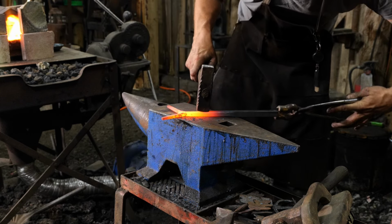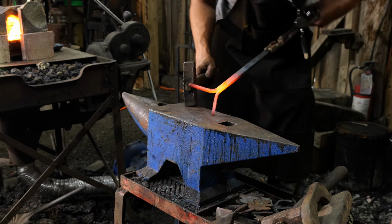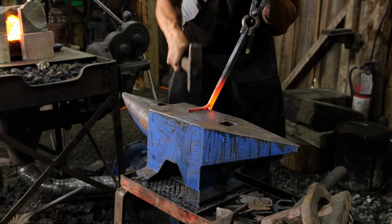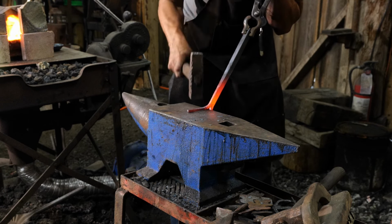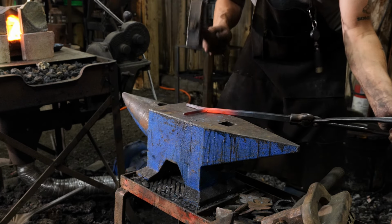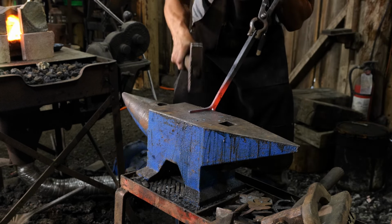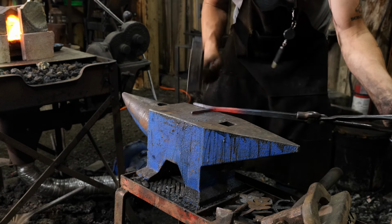And now Thomas is going to try to create, instead of a barbecue roasting fork, what we're trying to accomplish instead is that same asymmetrical taper that we did for the handle, but now we are doing it in the plane like you see it. So we're going to thin it in the top and down direction that Thomas was just working on. And then like he is right now, we're going to correct the parent bar thickness as we thin that down for our little rat's tail, our little scrolly end.